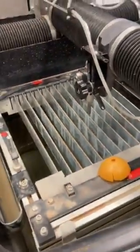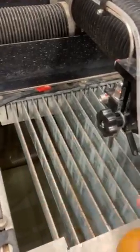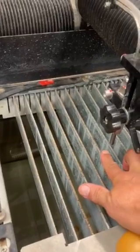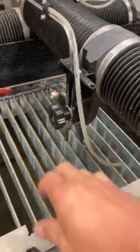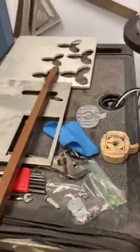The bed on this machine is a 12 inch by 12 inch, so you have an X/Y of 12 by 12. The Z axis will drop to a preset height above your material, so you're only cutting in 2D. That's a consideration — you can cut out any materials, but you cannot create a third dimension cut out of it.